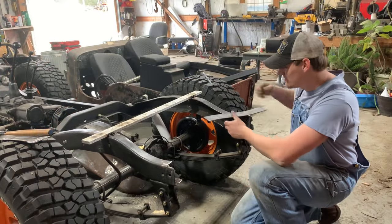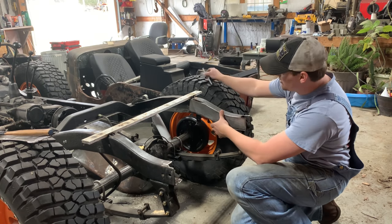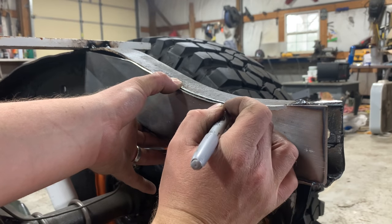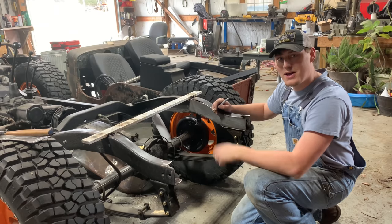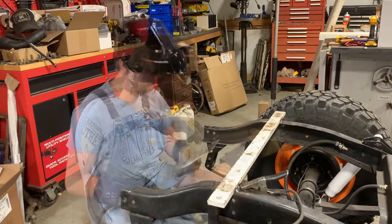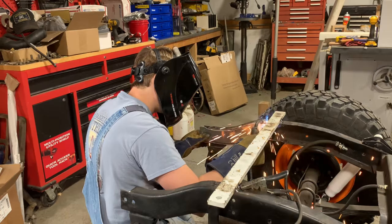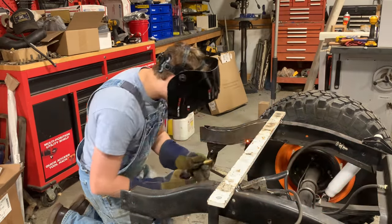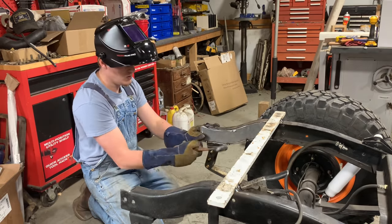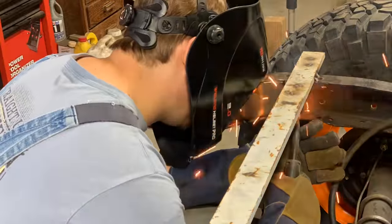Here's a little tech tip I want to share with y'all. When you're grinding your plate to fit, stick it up there and see what you got. Line the ends up, and then I've got some places that are interference right now, so I'll take a sharpie and mark any high spot or low spot. When you take it back off, you'll know where to grind it. I went ahead and chamfered the edges on this, chamfered the edges of the frame, got it all cleaned up. Let's go ahead and burn these in.